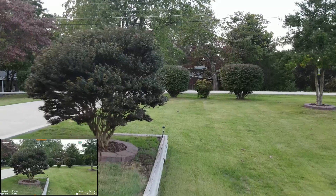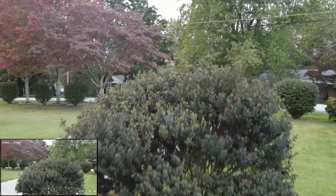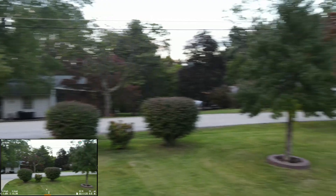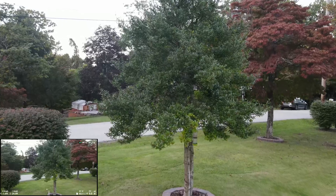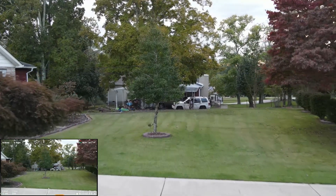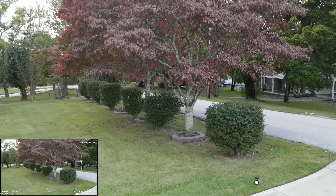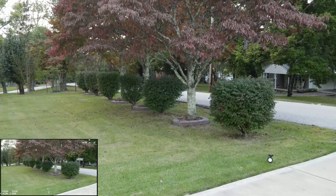What probably happens here is there's airspace within the field of view of the sensor that's pretty apparent, so it says it can safely fly over that. But in the case of flying toward this holly tree, maybe the top of that tree is still inside the view of the sensor, so it doesn't try to go up and over — instead it tries to go around. Keeping in mind it does not have side sensors, it just has to adjust based upon what it anticipated it needed as the amount of side offset to fly around that tree.